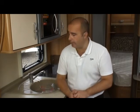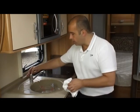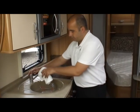Okay, so that's the system built back up to 15 PSI and we're now ready to drain down our cold tap. So what we'll do is just turn the tap all the way to cold and, remembering your cloth, just release.